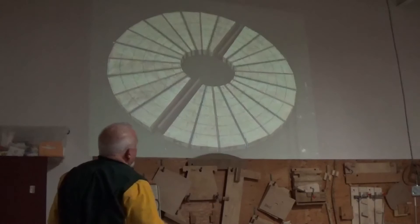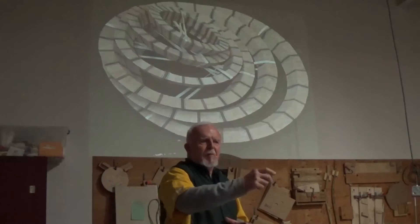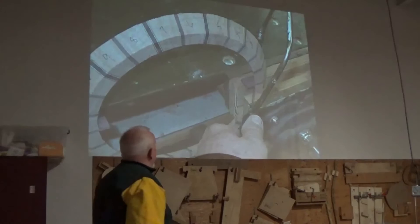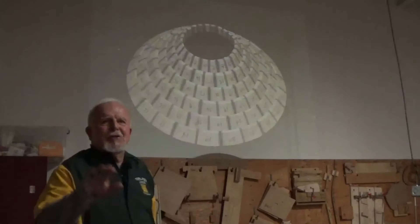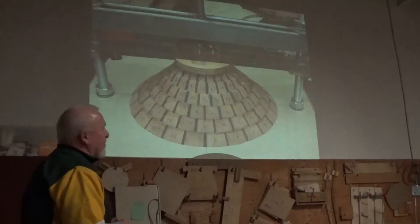I take the band clamp off, take those two pieces of purple heart out, and start cutting it on the bandsaw. Then the rubber band action again — I get them all glued together. To glue the two halves together I took the purple heart sections I had cut out, cut them into sections, and had a little section of purple heart in each half. Then to get rid of them, I took a coping saw and cut the excess off after the glue dried. Now they're all ready to restack. They're stacked together — obviously I didn't do a great job laying this out because I have some steps, but it didn't really matter; I had plenty to work with.